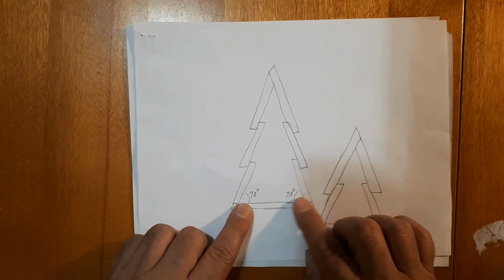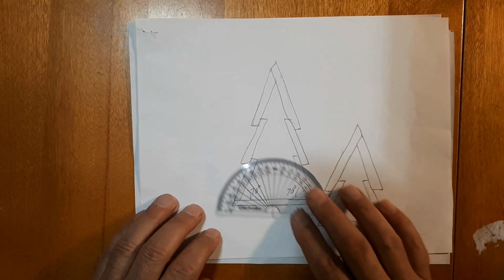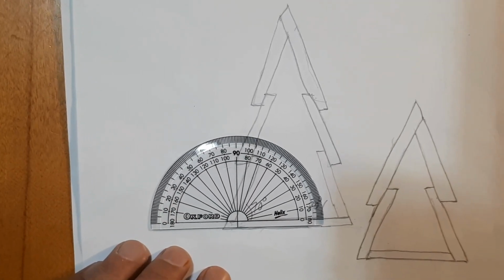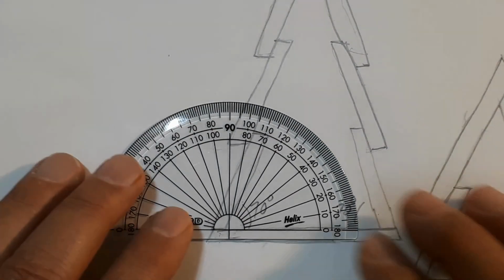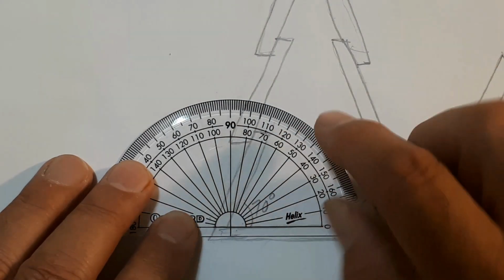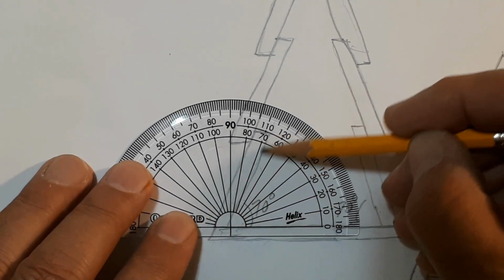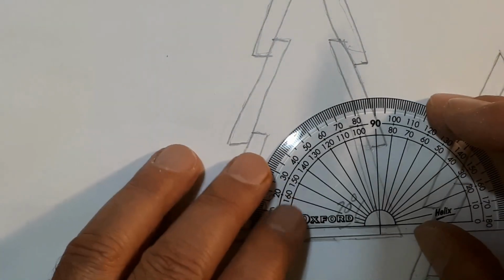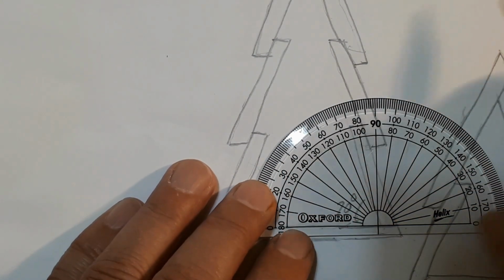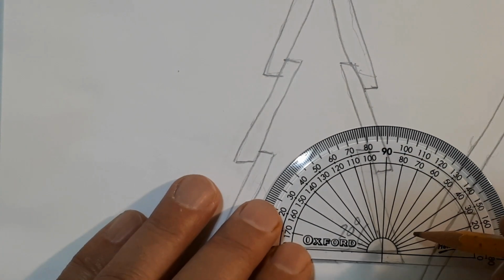What I needed to determine was these two angles. I already wrote down 70, but here's what I did. I put my protractor on here. Bring you a little bit closer. And this angle, according to my sketch, is just about at 70. There's 70 degrees, sweeping from the 0 upward to almost 70. And doing the other side, a similar thing, sweeping from the left, and this one's about 75, well, obviously, coming from a picture.